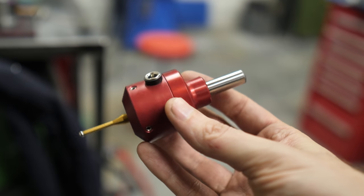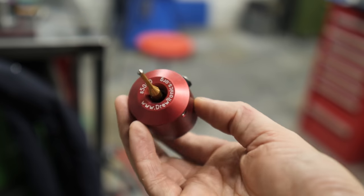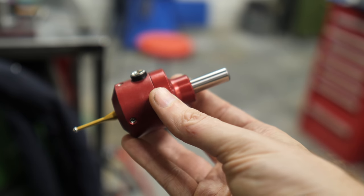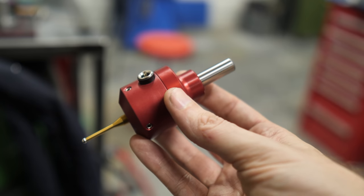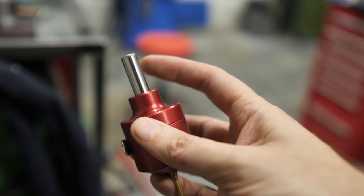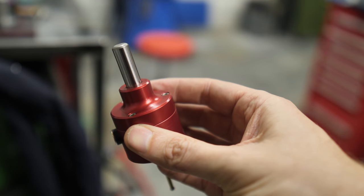All right, for the first project on this tool post grinder, I thought I'd go ahead and modify this probe. This is made by a company called Drewtronics. I think they're out in Texas. Not a sponsor of the video, but they do make a pretty good probe. We'll get more into the details on this guy when we get to it in the CNC. But I bought it with this 3/8 inch shank, and we need a 3/4 inch shank. You can actually buy it that way, but it costs a fair bit more. So we'll go ahead and make our own.